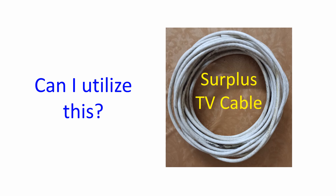In both these matching methods, they have specified the wavelengths of the operating frequency. So I am not sure what will happen if I use 75 ohm cable with either of these matching methods for both VHF and UHF in a dual band antenna like a Moxon Yagi — will it still work, given that the UHF ham radio band is on the third harmonic of the VHF band? Concern is there for both TX and RX, as my main operation is on LEO satellites, and any mismatch is likely to prevent me from hearing the already weak signals of LEO satellites.